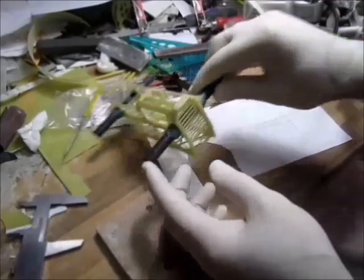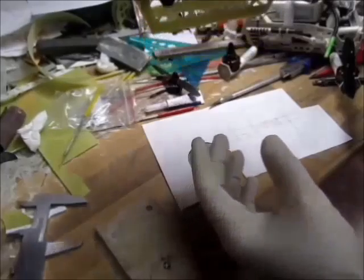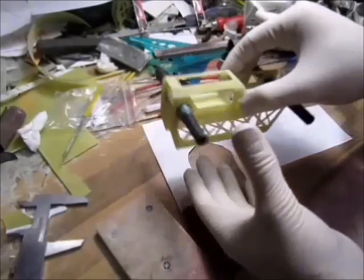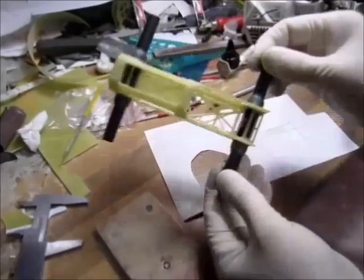as much as others. On the other hand, with the tilt, if you drop the throttle when you're horizontal, it doesn't go in its own prop wash, so there's less wobbles, easier to tune PIDs. It's just a lot more messing.